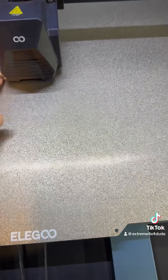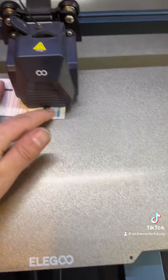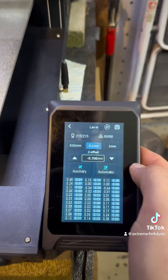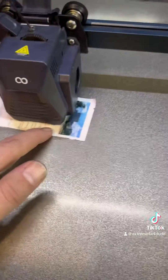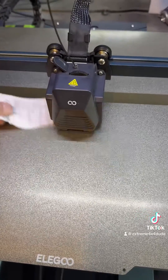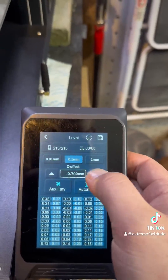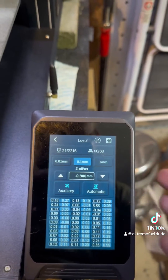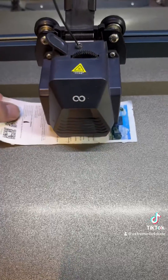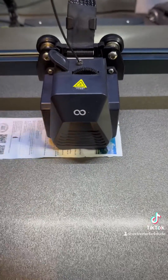What you want to do is achieve it so your piece of paper slides underneath that hot end nozzle without resistance. Get it to the point where it doesn't have hardly any resistance. If it's moving freely like this, you have too much gap — you want to close that gap. So I'm going to lower my nozzle now until there's resistance to the point where it's hard to pull the piece of paper out.